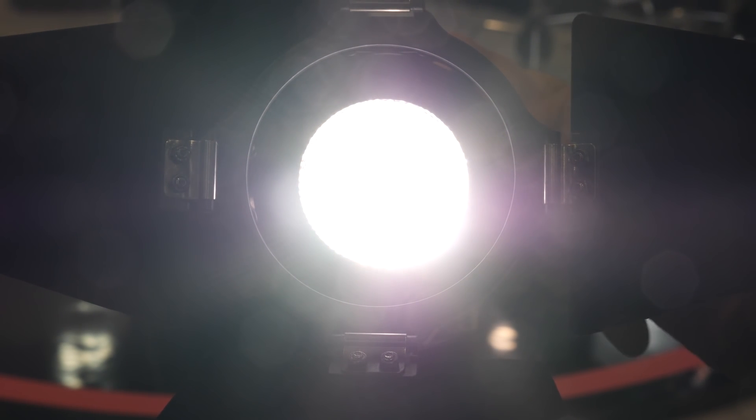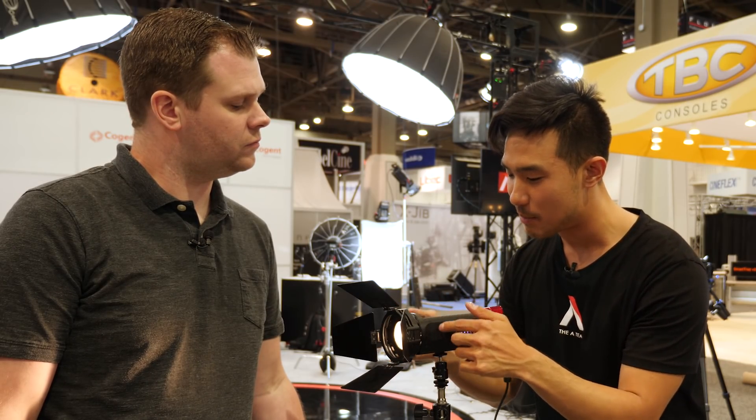Because it's a single source, it's got two requirements: one, it's got to make one shadow, and two, the light needs to mix perfectly. So we did some really tricky things. There is no bicolor single source model at this size. Traditionally to do a bicolor single source LED, you have one big 3200 and one big 5600, and you try to mix them - and then you get two shadows because you've got two LEDs. So what we've done is: on the outside it's kind of a ring, basically a 10,000 Kelvin - so it's blue. On the inside, we've got a 3200 Kelvin. The two of those make sure it stays one single source. However, that doesn't solve your mixing problem. To solve that, we've got a little silver chamber built in right here. So before the light comes out, it bounces around in a little chamber and then shoots out to make sure that light is perfectly mixed.